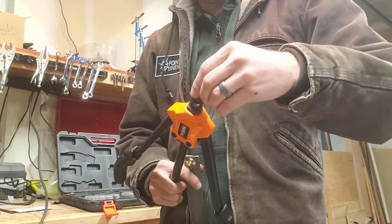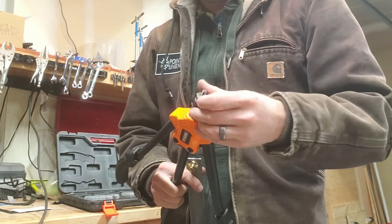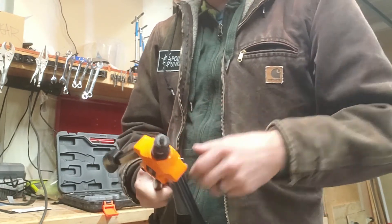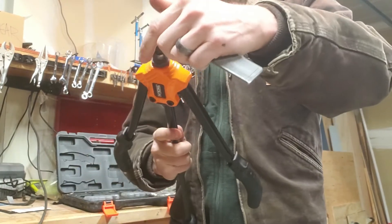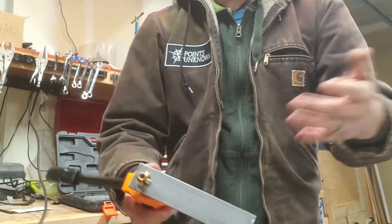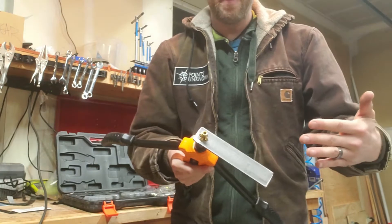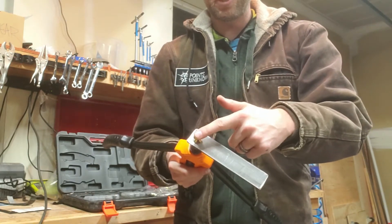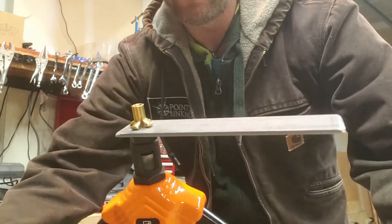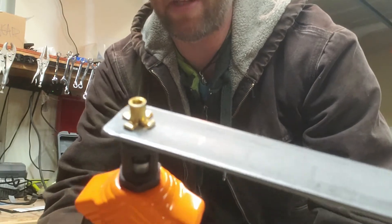So what I do instead is pull it off and put the regular anvil back on the tool. It seems to be fine just like that. Then I put it back on — and if I was going to place a lot of PlusNuts in a row, I would do all of them kind of halfway with the washer, then go back through with the main anvil. You can see now when I do it, I pull it tight, it shrinks all the way in, really sticks in there, gets it nice and tight.